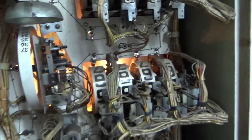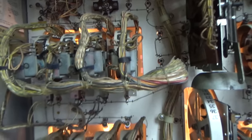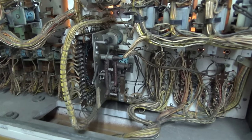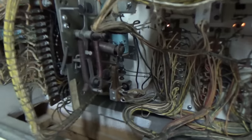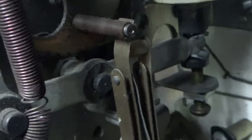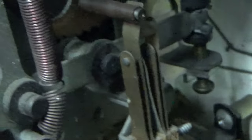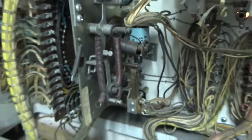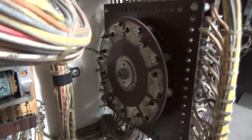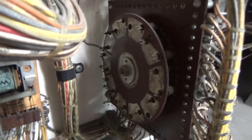You may notice they are all at zero, so at some point it reset just fine. The first thing we're going to do is start on the player unit — clean the switch here. See how that blade's bent? It probably shouldn't be like that. Basically when it gets back to zero, that should probably open. We need to take this wheel off so we can clean the rivets and everything on the disc and make sure everything is making good contact.